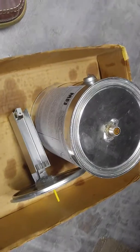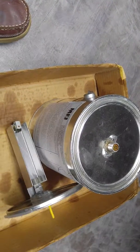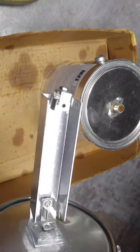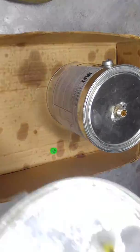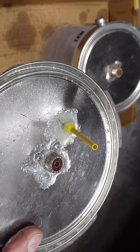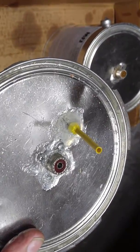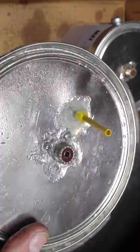One thing I wanted to show you — trying to use the amplifier today and test it, I became very dissatisfied with my MFJ antenna tuner dummy load. This is the original lid. There's a slot in here for a 50-ohm resistor that connects to the top, and the top has a connector on it. I put a snorkel on there to keep the oil from blowing out because the original seal was not very good.